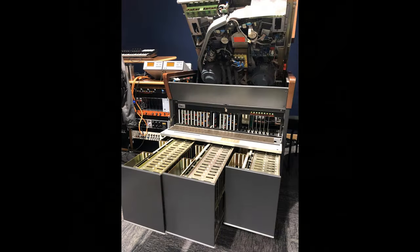In this image of an A820 you can see the 3 card racks slid out from under the deck plate, each holding 8 complete audio channels worth of cards. The A820 card functions were on discrete cards per channel — one card for the record amps, another for the replay, and a further one for the sync function. This in turn required expensive hardware racks and labour intensive internal interconnection wiring.